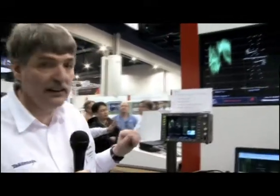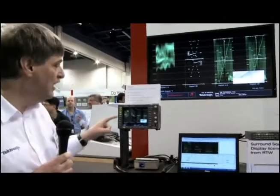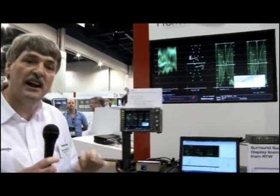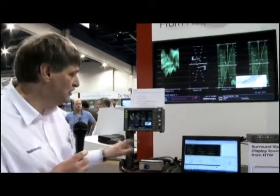In the standard configuration, you can do just a single input, but with the camera balance option, that gives you the ability to parade the display for four inputs. This is ideal for balancing cameras in a studio or in a mobile truck application where you want each camera to have the same luma level between each of the channels.